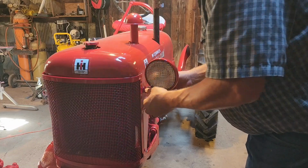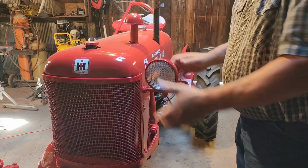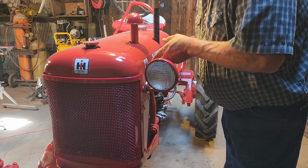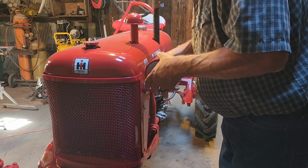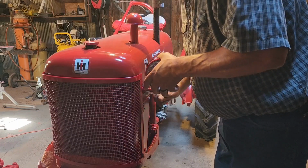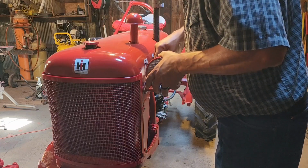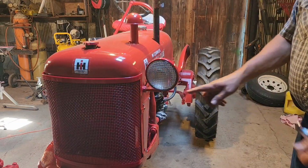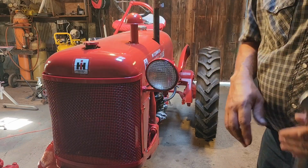So that's probably about as far as we need to go. So let's go get a wrench and we'll tighten up this jam nut and we'll be good. Now this nut is a 1-inch size nut. And then I want to make our lights pretty much vertical. So that looks good. We'll just tighten this jam nut down. And I think our lock washer is going to make good connection because, again, we want to make a good ground connection. There we go. So we'll come back later, we'll loosen this and straighten our headlight out. Well, I'll put the other one on, then we'll get the wiring.